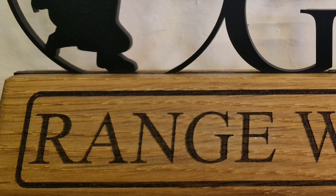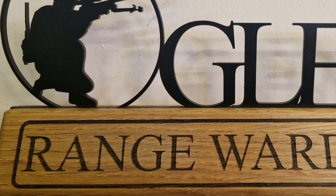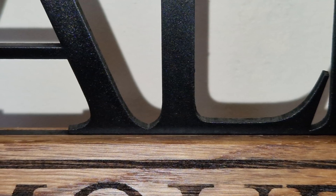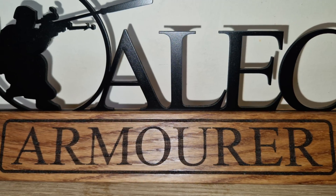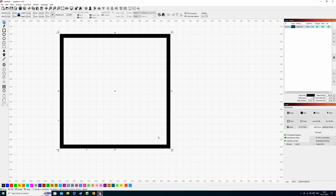For the projects I've had to produce for people in the past — I do a lot of leaving gifts for military personnel. What gets requested a lot is table names: if someone's been on station for a certain amount of years and is getting posted, people like to give table names with their rank, name, and how long they've been there, and those have a border around the outside. I have saved so much time with this offset fill setting in Lightburn. It was taking me like half an hour to do one of these, and if several people were leaving from the same section it would take nearly a day to get all the products out — whereas now it's drastically decreased.